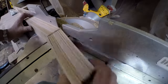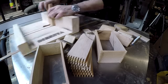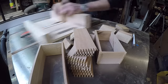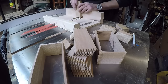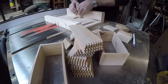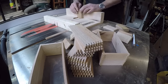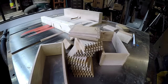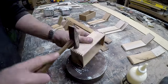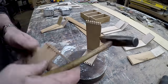I'm making small box joints, and each one is going to be a three-by-six-inch box. My box joint jig is now set up for the regular kerf blade — I moved those rails over and changed out the stopper to the thin stopper. The quarter-inch slot is still there, just not being used. These smaller pieces are a little harder to handle because I was doing them in stacks of five. Now I assemble the boxes, and that chunk of steel helps me hammer them together — the glue also goes on the chunk of steel and scrapes right off.